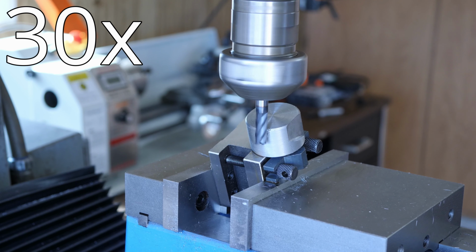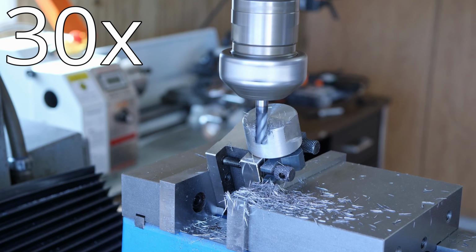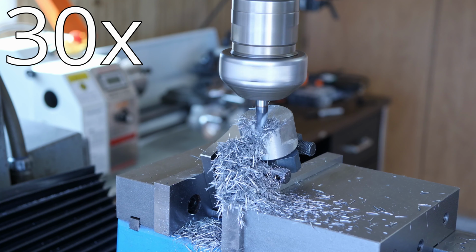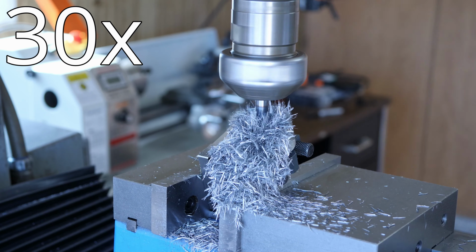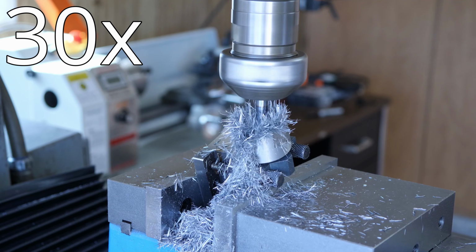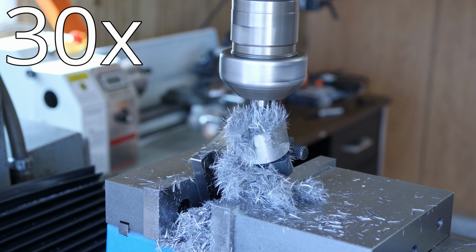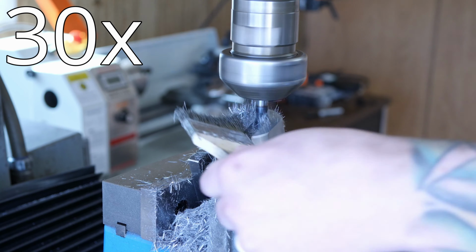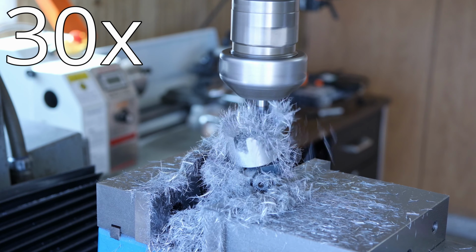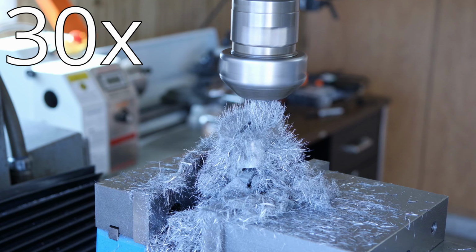With that done, I moved over to cut the slot. This was a really deep cut, almost a full inch at the deepest, at full width on the 3/8 inch end mill, but Gordy didn't mind. However, I made two big mistakes. First, I forgot to leave enough material for a finishing pass. Second, I forgot to lock the slide and the hand wheel turned, completely ruining that wall.